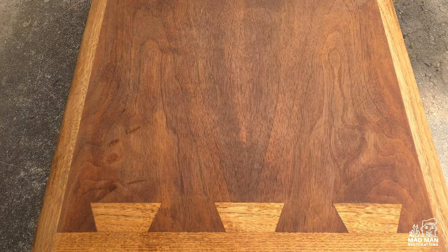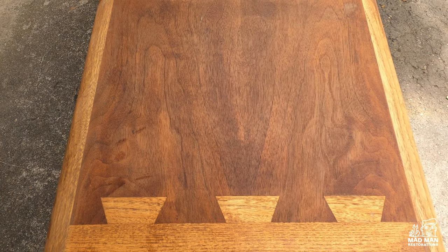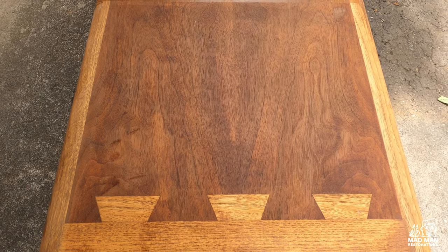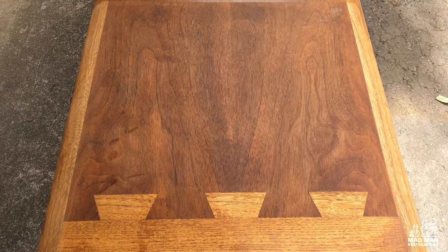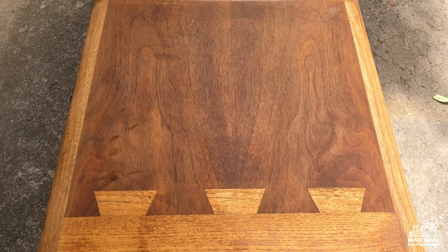However, I highly advise against leaving it on that long — it can cause the wood to darken even more, and even worse, it can cause the substrate to swell underneath the veneer. Clean Strip did a pretty good job at removing the finish. I don't have any major complaints — it did what it was supposed to do.